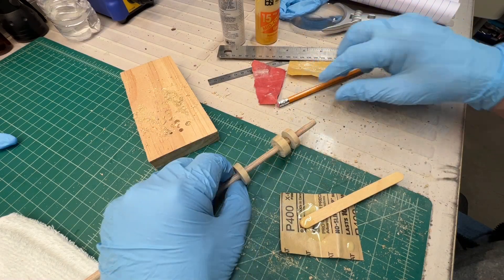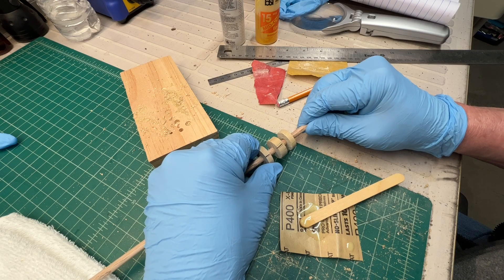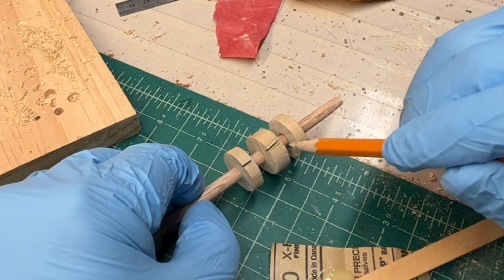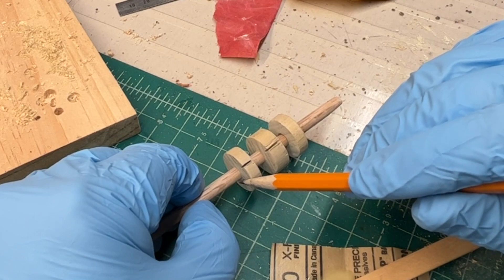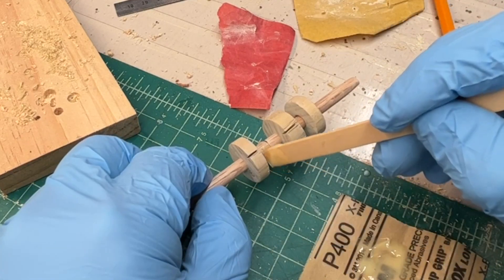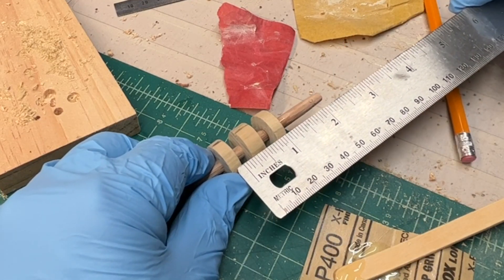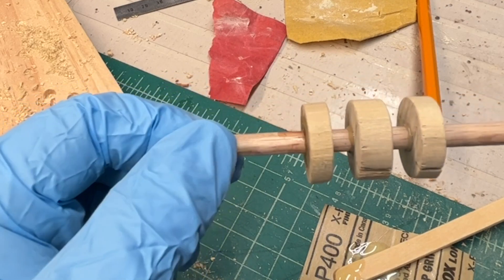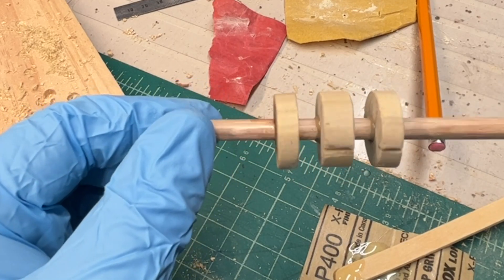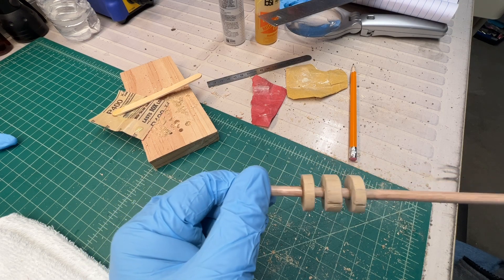That's close enough. Let me do the third one now. You'll see the grooves I cut in the spacers to allow the magnet wire to go from the bottom coil up to the top itself. The epoxy I'm using has got about a 15-minute working time, so I've got plenty of a wide enough window to do what I need. I'm satisfied with those results.